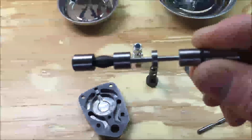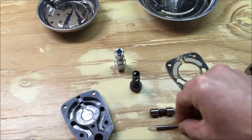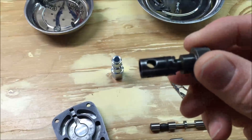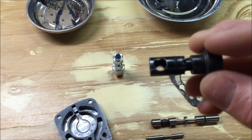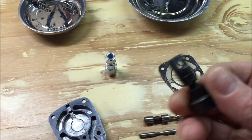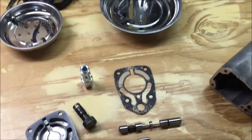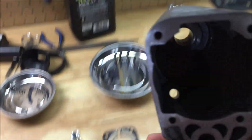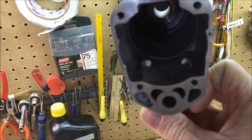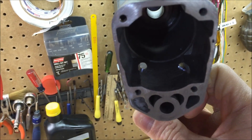So the parts are machined down — cut down to about half of what they were, if not more. Same thing with the little trigger nozzle. Drilled out the fittings. For this piece here, I only drilled out two of the four holes because to drill them all out I wouldn't have anything left. But really that's all you'd need — two size holes like that. I had to make a new gasket because the other one disintegrated and I couldn't get it off in one piece. The only other thing I did — which I hadn't really planned — was the exhaust holes. I drilled those out about a drill size bigger because the originals had a lot of casting material in them, so I just ran a drill bit through to clean them up.